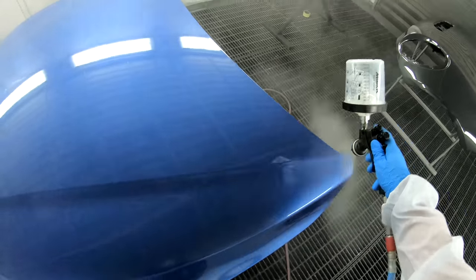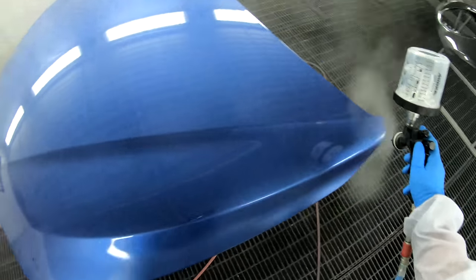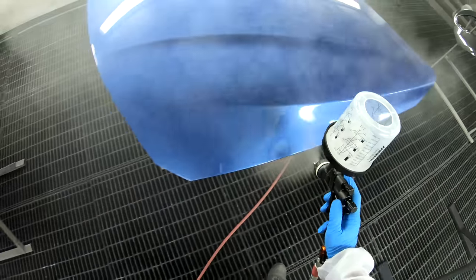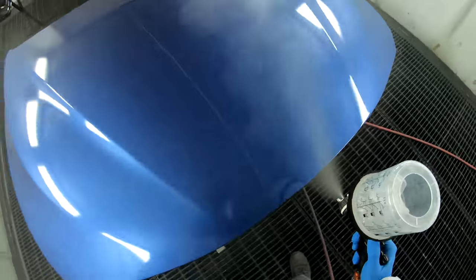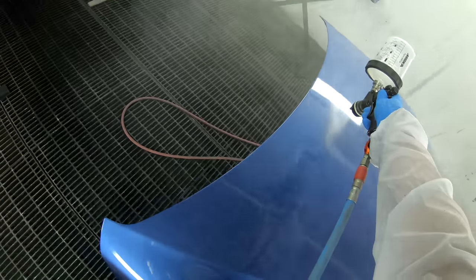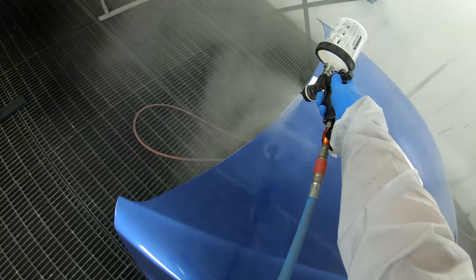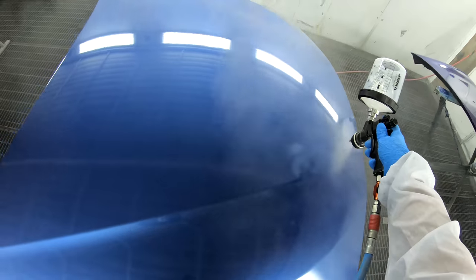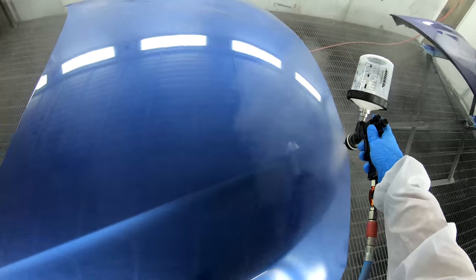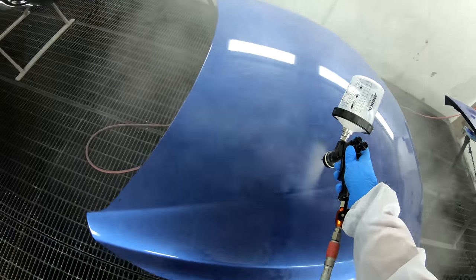One thing I will say is — wow — these master pots that I'm looking at, look at how much that bag collapses. It's fantastic. You've got constant flow of lacquer the whole time until it's done, which is what you should have. I have noticed on some brands they don't collapse as well — you get to about 80% and then your flow will slow down, so you have to slow your working speed to keep up with what's coming out of the pot.